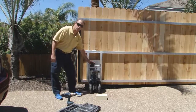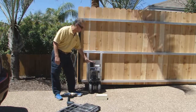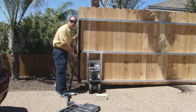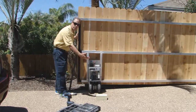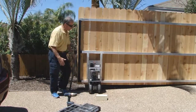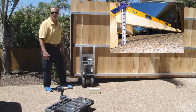This is our Gator Power Gate. We've already taken the hood off of it — it's only four screws to pull the hood off. We just lined it up on the lowest point of the slope of the driveway or pathway, and we put the gate in its lowest spot, so you can see how it slopes down as far as five and a half inches.